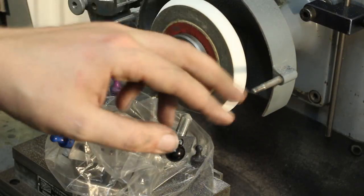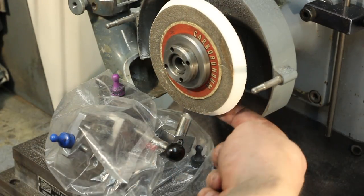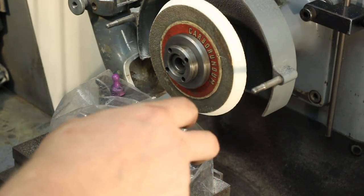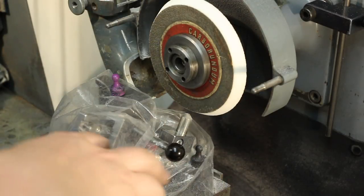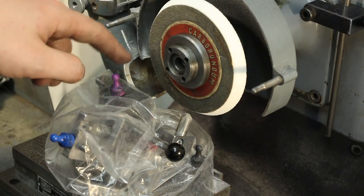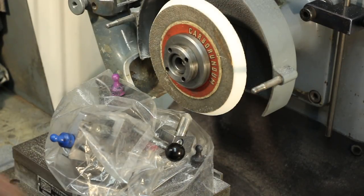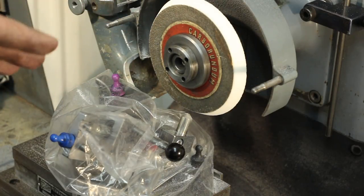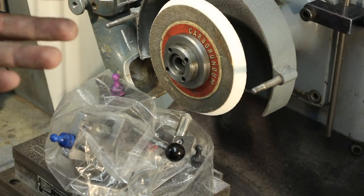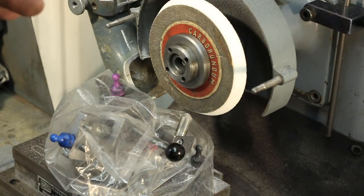There we go — one nice 30-degree tapered grinding wheel. Now I would just have to dress the rear side of the wheel square to the table and I could grind a prismatic way or a side of a dovetail or whatever I want to grind. With the dust extraction directly behind the dresser the mess is also reasonable, but still dressing a wheel to a shape is a horrendous mess. We have some diaform pantograph dressers that work on our Jung surface grinders, and when the guys do large profile dressing on those wheels with the diaform, that's quite messy.